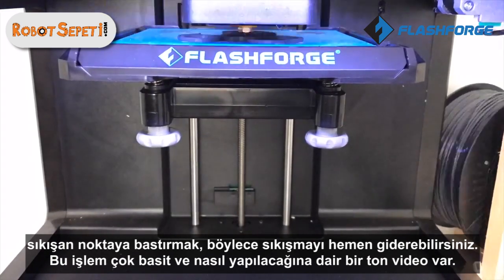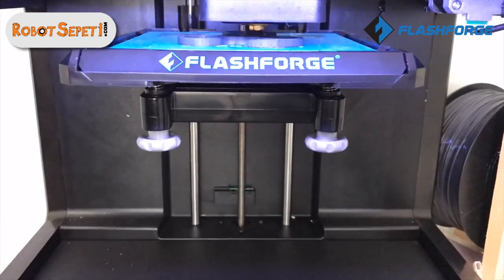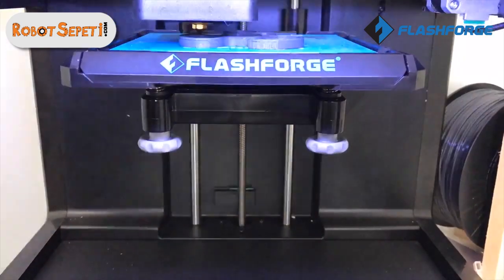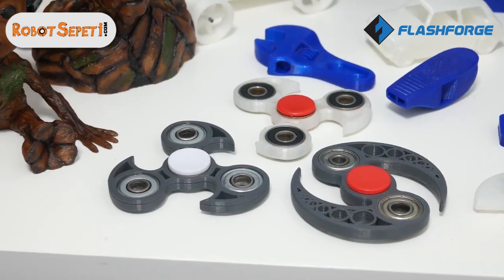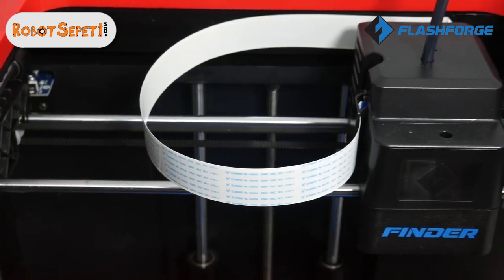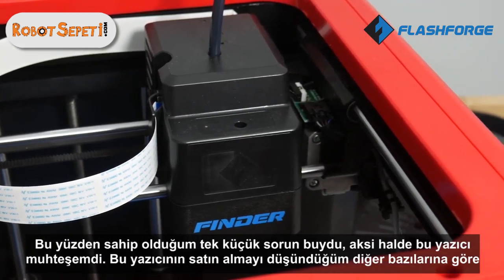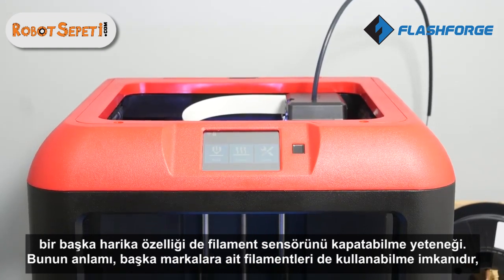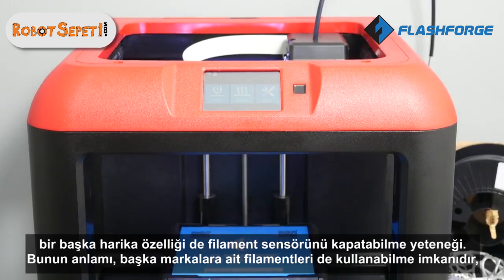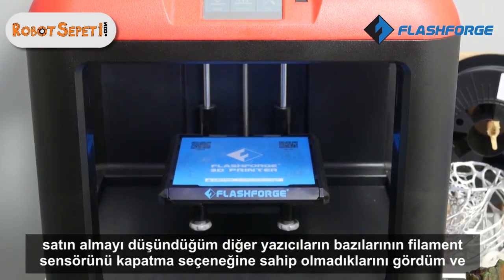Here's a quick time-lapse video of a fidget spinner that I printed. Now since I've had it, I've had one occasion where the extruder was jammed. All you have to do is open a couple of screws from the extruder head, and there's a needle tool that you push in once the extruder is hot and you can just unjam it — it's very simple. There are also a ton of videos on how to do it, so that was the only small problem I had.